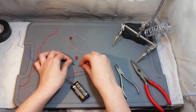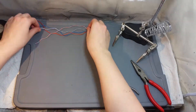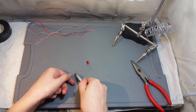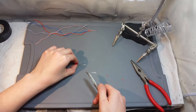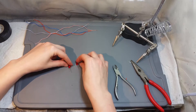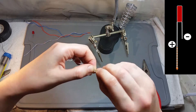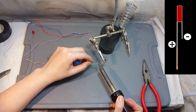I'm gonna continue by stripping the tips of these wires. I'm gonna also trim a little bit the legs of these LED lights but I'll keep the proportion of length, otherwise I'm gonna forget which side is positive or negative. I'm just trimming them a little bit so they are easier to be inserted inside the eyes of the 3D printed model. Now I'm gonna take one of these striped wires and I'm gonna solder it to the longest pin of the LED light — the longest pin is the positive one.